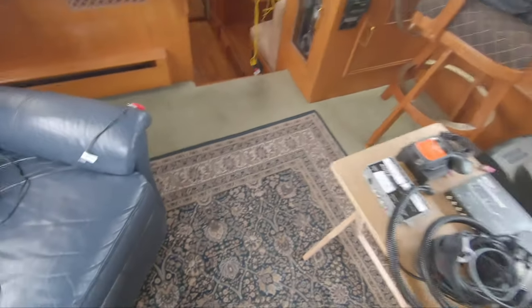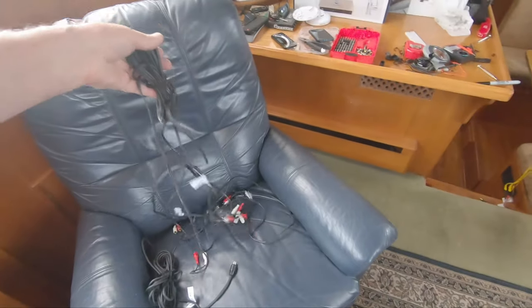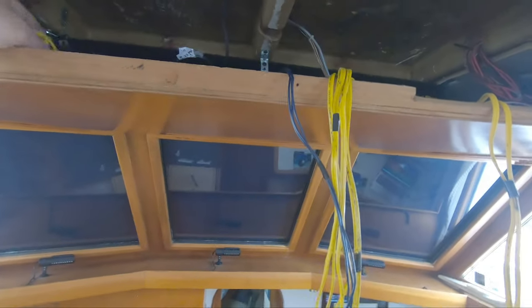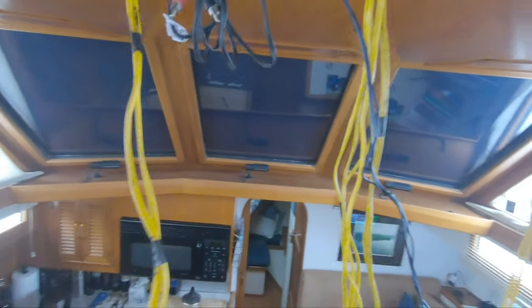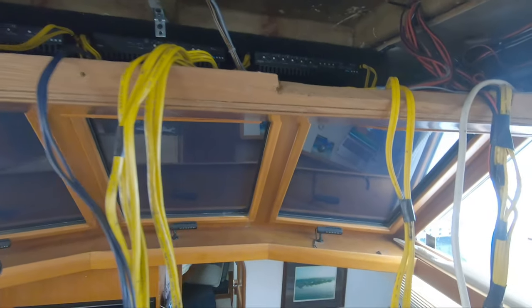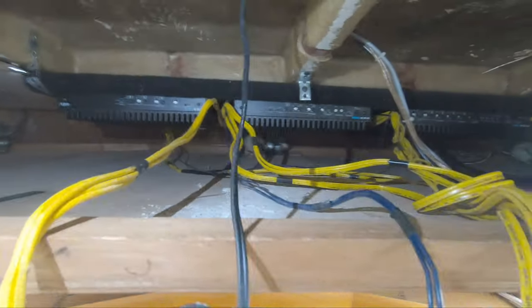There was this long cable between the CD changer and the input device. We just had a bunch of RCAs and power over here. What I have still dangling out of the roof is everything I could push out of there. What I have left are the things going into that audio control unit, and I think we're going to find all of these go into an amplifier. The rest of these speaker cables are going into the amplifiers.